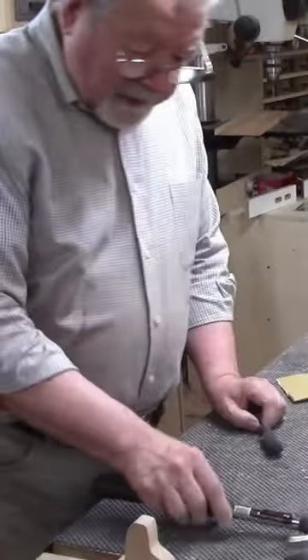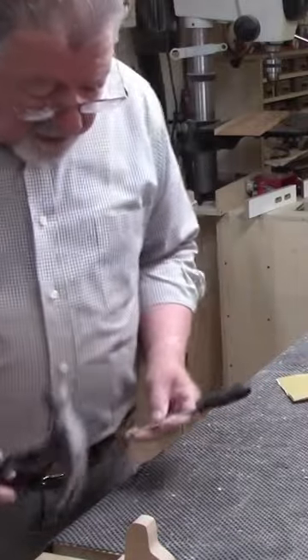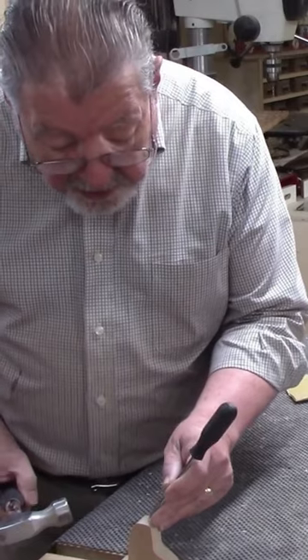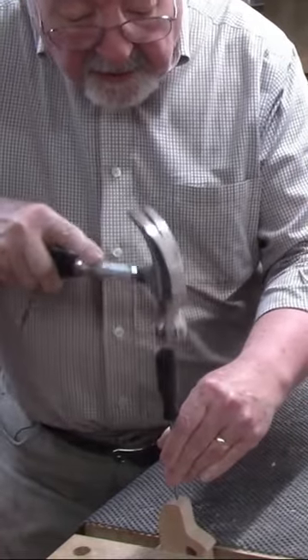The thickness is right. My experience is the drill bit wants to wander, so in order to make sure it starts where you want, just take a little center punch right in the center of that area and punch that.